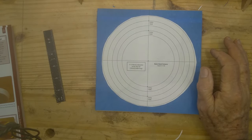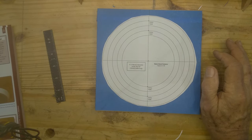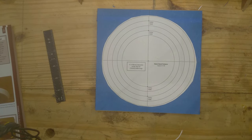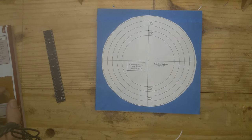I've got to set my saw to 28 degrees. I've got to put a new blade in. I'm going to see what I've got. Either a number 7 of one brand, Pegasus brand, or a number 9 of a Flying Dutchman. I might not have a 7 Pegasus, but I'll have to go there and see. I'll get the saw mount set up for that. Then we'll move it over there and we'll cut the first outline. That's the first step.